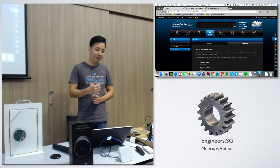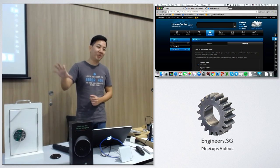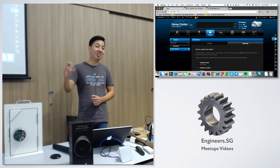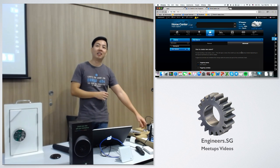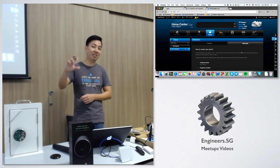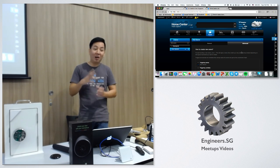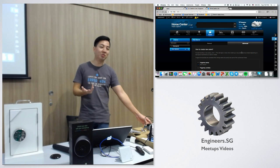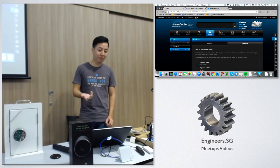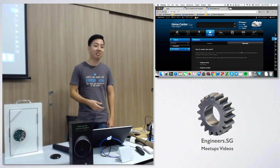It's because in my own place, when you don't switch off your electric appliances, that standby is also taking a lot of power. The standby for all these modules is less than half a watt. So in a way, if you use this to manage those standby electrical appliances, you actually save compared to just letting them go on standby. That is how you use it. But generally, if you have hundreds of these running at 0.5 watts, then you're always using 50 watts. So it doesn't increase tremendously. But if you use it correctly, it actually decreases.